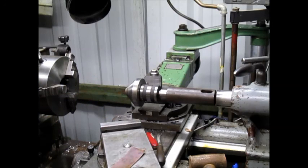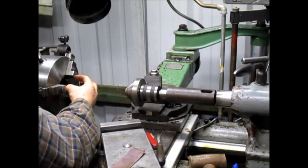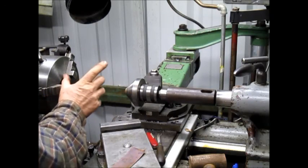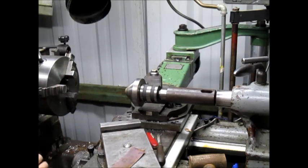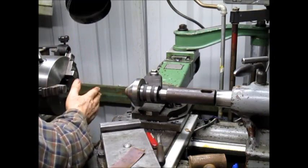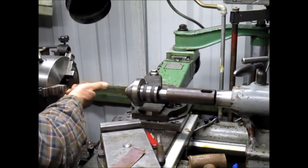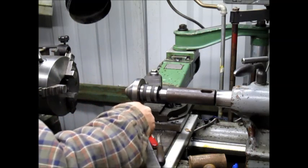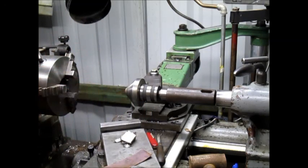So I think what I'm going to do is come in with a plug of steel, and I'm going to taper that steel at 60 degrees, and then I'm going to put the hub in between that. So then I'll have center, and I'll have a good true measurement. So then we can measure the hub and see what's going on. So next thing I have to do is go find a piece of metal that I can taper the center.